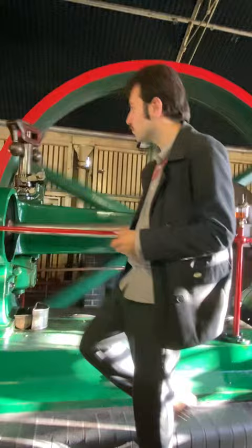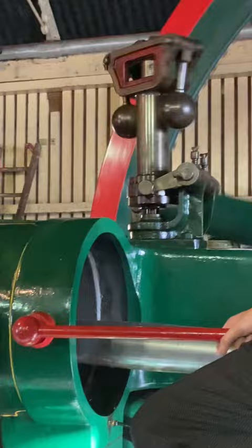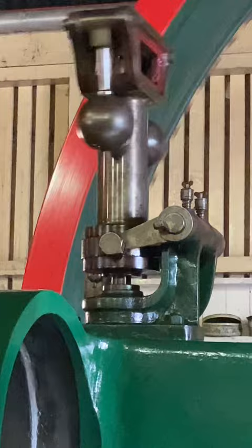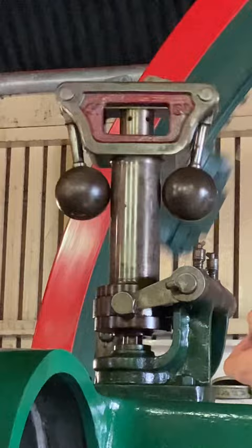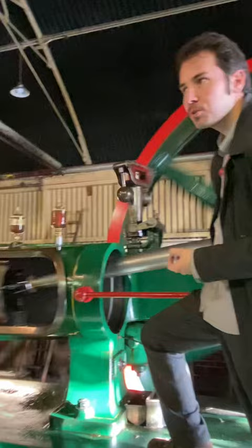There are a few other systems worth mentioning. Next door we've got a lubrication system — a little oil feed that lubricates all metal-on-metal surfaces to decrease friction, so we're not having to replace components constantly. And this spinning device is a Watt centrifugal governor, named after James Watt who invented it. It limits the top speed of the flywheel to 70 revolutions per minute. If it went any faster, the out-of-balance force created by the ropes going around it could shear the shaft. If you break that shaft, the flywheel weighs six tons — with that much momentum it wouldn't just fall down and stop, it would roll straight through that wall. Ironically, next door is the pub and brewery, and we definitely can't have that!